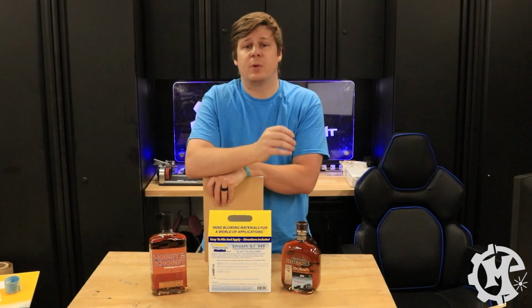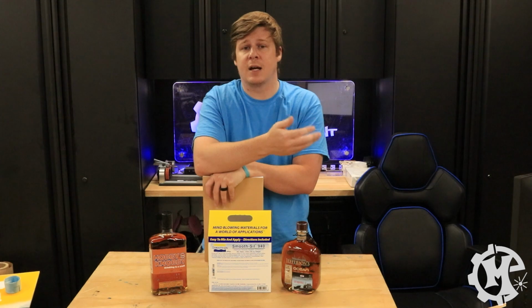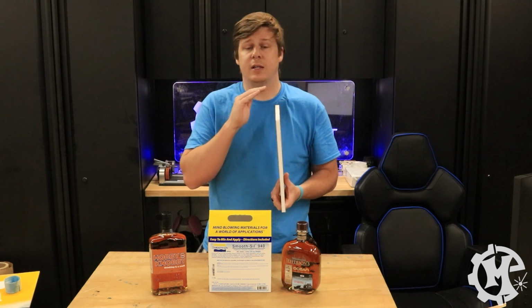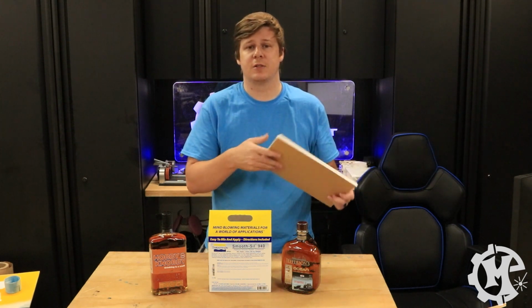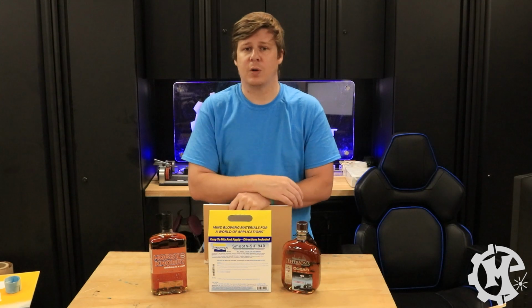So in order to make the mold, I actually need to make the shape that I want to have as the ice cube. So for that, I'm going to be attempting to use 1/2 inch thick acrylic. The goal here is to laser cut the pieces out of the 1/2 inch acrylic, be able to put them into a box that I'm going to make and cast them into the mold.